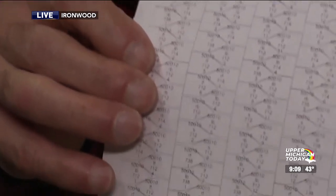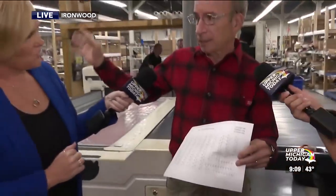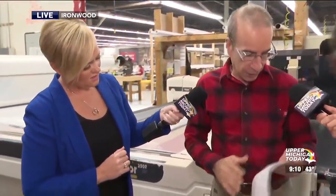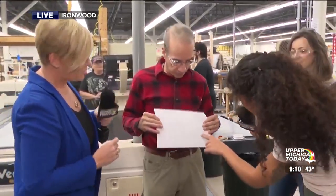Most cutting of fabric is done with multiple plies. If you look up in the corner, there are going to be 12 layers cut at the same time. The fabric came from the warehouse down onto the cutting table and got laid up into a section that is three yards — basically nine feet long — with 12 layers of it. We're going to watch the process now.